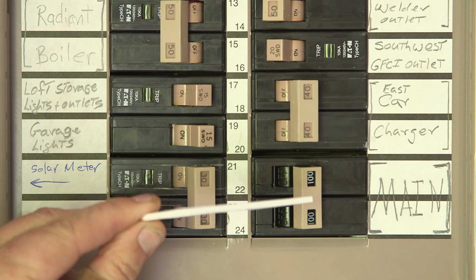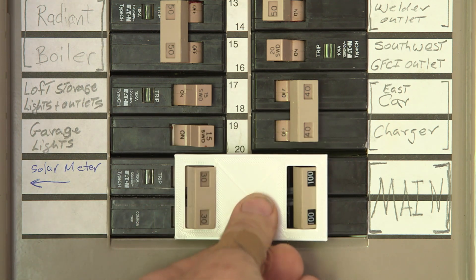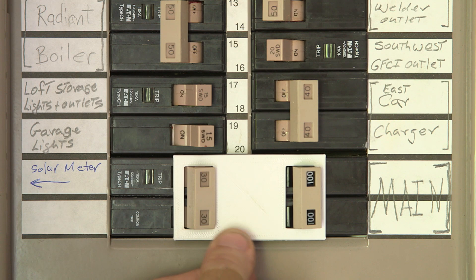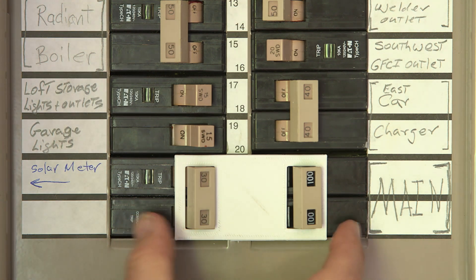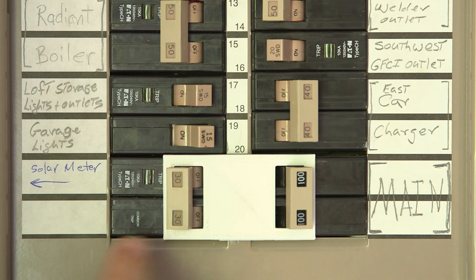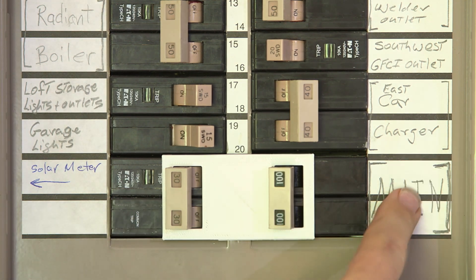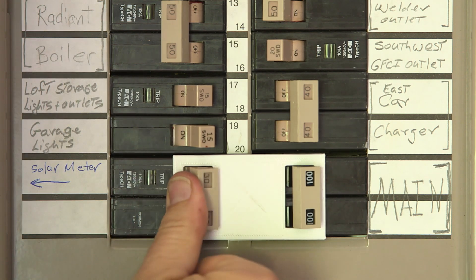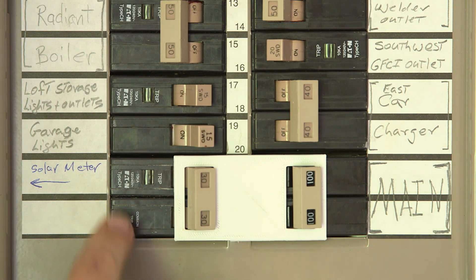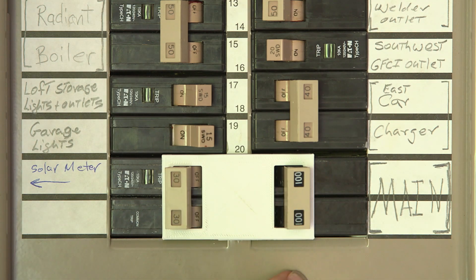Now I just printed this very thin because it meant it would be a very quick print — rapid prototyping. I just wanted to make sure that it would fit on here, because even this thin piece took about 25 minutes or so to print. But if you'll notice with this on here, if I move one breaker it's going to move the other. Main breaker on, this breaker off. Now they're both off. Now the main breaker is on and this breaker is off. So the shape of this allows for both breakers to be off or one or the other to be on, but never both of them at the same time.